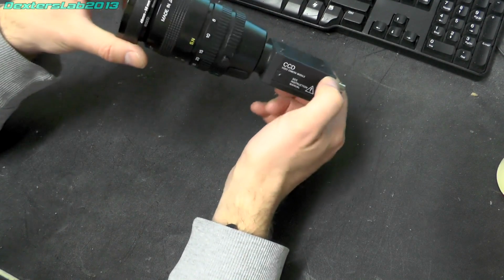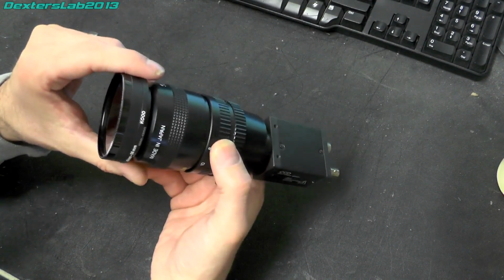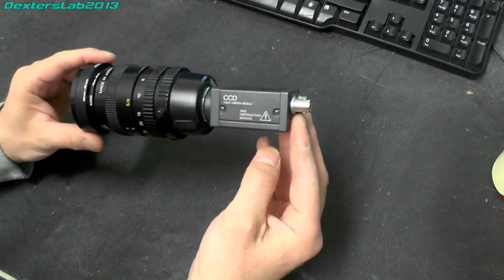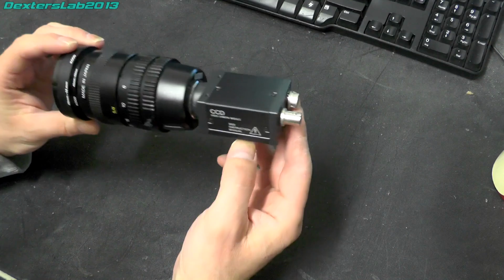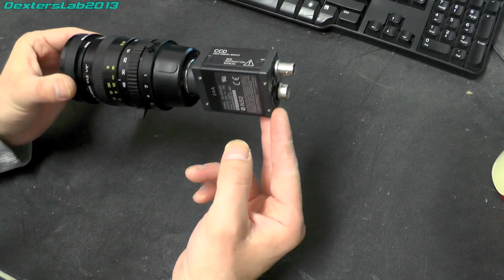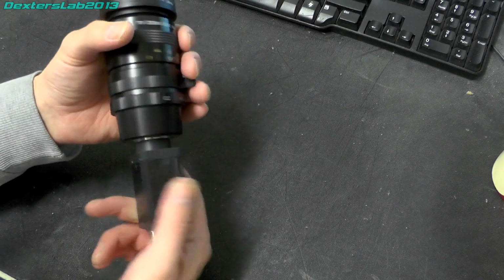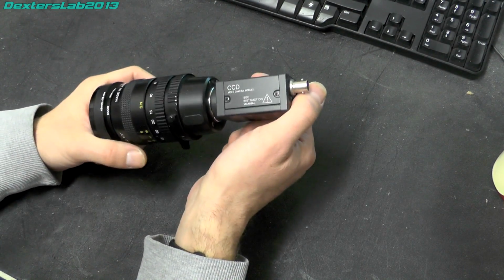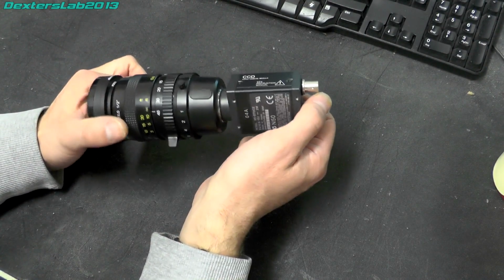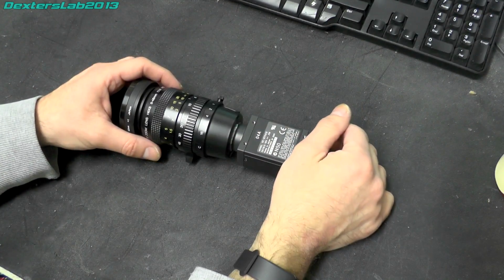It's actually only black and white, but it outputs a full res 625 line video signal. The point with it is it has a fully manual shutter all the way up to 0.008 of a second, and it has external triggering and sync options, meaning it will capture high-speed events with very precise timing. And it also came with this really nice f1 C-mount lens. Now obviously this is not a high-speed video camera. This is going to be more like a high-speed still camera, so it will take single shots at hopefully 0.008 of a second.